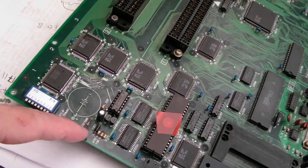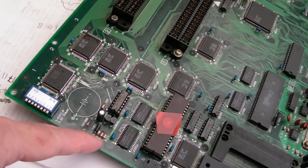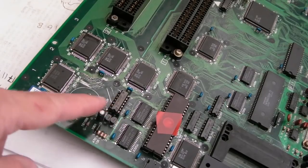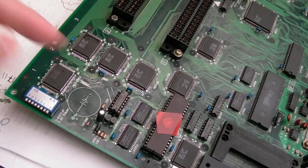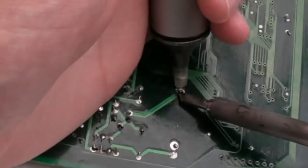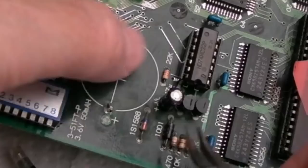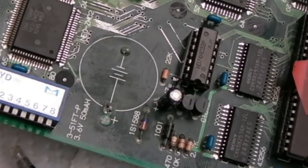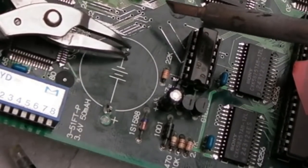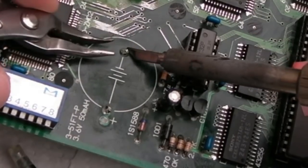You know, I'm going to scratch up the solder point, use some desolder braid, suck off the old solder, just like I did with these down here, and they don't look too bad actually. But with these here, you know, they'll all be off and the pads cleaned up and new cap. Let's get those battery contacts out while I think ahead as well. Yeah, you see the solder's really crusty here, isn't it? So this is where it might be easier just to try and heat from this side and pull through from this side, actually. Mind you, there's still a little to grab there.